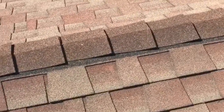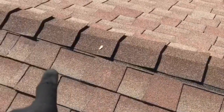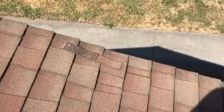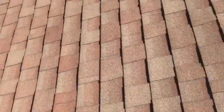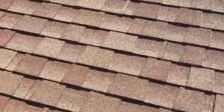This is a composition shingle roof — dimensional. You can see right here the installers tried to save a little money; they left out that top course. There are a couple damaged shingles and a little repair job down here, and someone else did a couple scuff shingles. This roof looks pretty good, although it is getting older — it's probably over 20 years old.